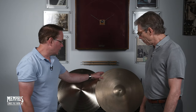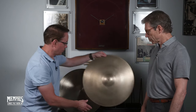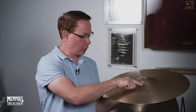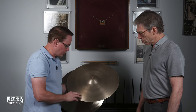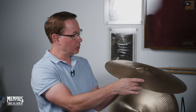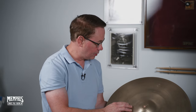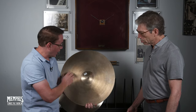Well, Jim was kind enough to send it to the Zildjian factory for us to look at. As a cymbal maker, I'm just going to pick it up as I do with cymbals — we like to look at the cup shape, the curvature, the type of hammering. This cymbal has developed a nice kind of patina, but you can see there's some distinctive hammering on here. We also look at the curvature, weigh it, and look at the lathing. This has the prototypical tonal grooves in it like an A Zildjian cymbal would have.